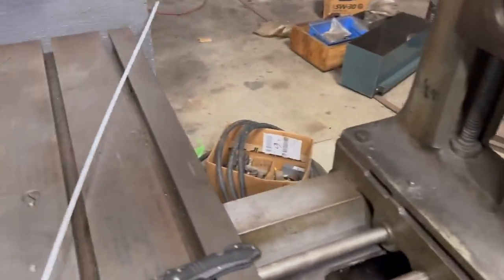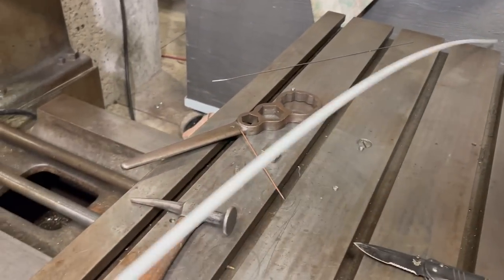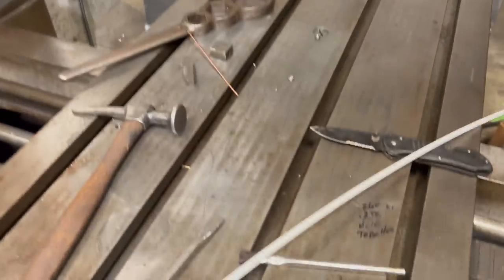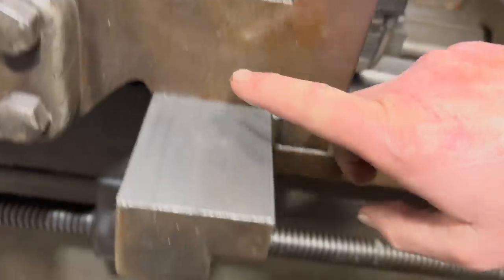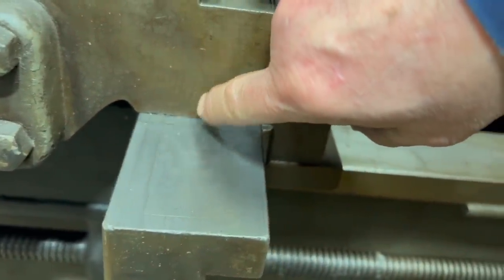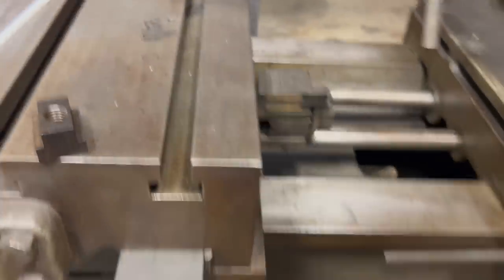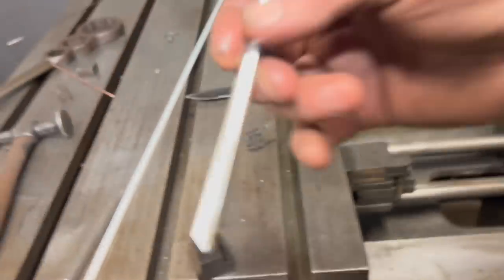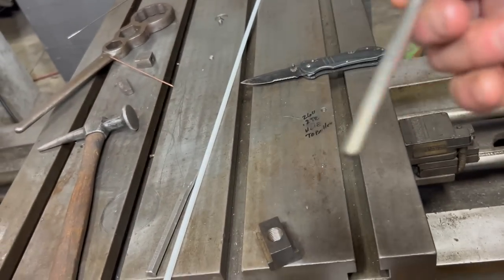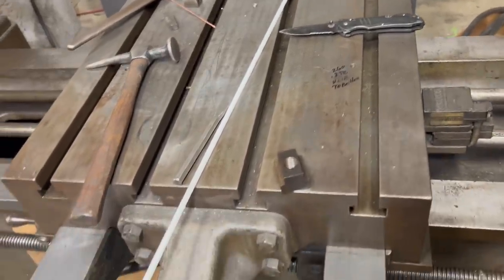Here we are with the oil passageways for the table — that's next up. This is a six-foot piece of nylon tubing I bought from McMaster for about six bucks. I'm going to snip off basically a three-quarter inch piece and that's going to ride in the hole from there to about three-quarters up. Then I'm going to fill the hole that's in the side with a piece of the handle off of an acid brush — I've got a zillion acid brushes, so we're good. That'll wrap up this section.